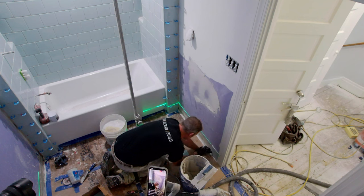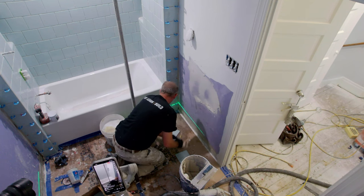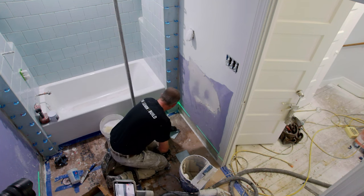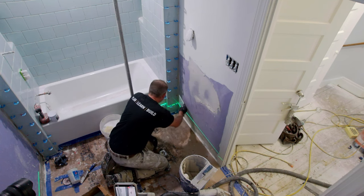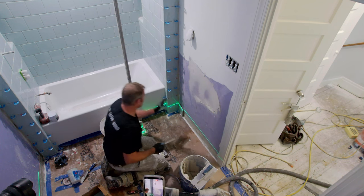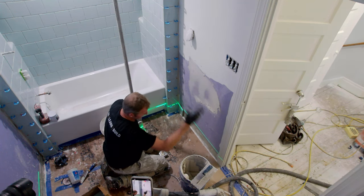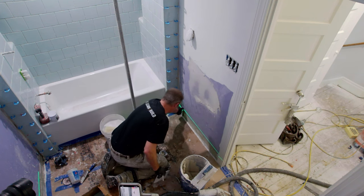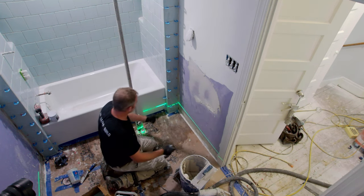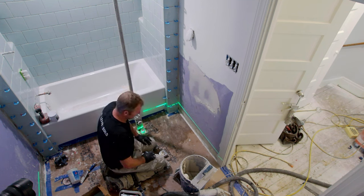See what we would do if we went this way. So that's like 1¾ inches. That 1¾ inches would look better. You know what? I think I'm just going to go with my full half pattern here in the corner, and then I'll have 1¾ inches and then a 4¾ inch piece going on here. So it's going to feel like you're bringing the tile from outside, from the shower, and bringing it over, and where it ends at the trim is where it ends. Really all personal preference, but I don't want to see an inch on either side. I think that's going to be too slender in the corners. I prefer having a good, almost a 2-inch piece would be ideal on that.